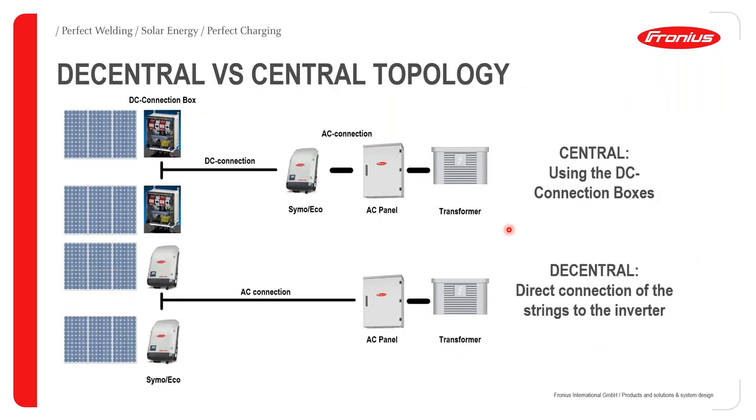In most cases, as in our large scale installations, both for centralized and decentralized topology, you can of course have our inverters well implemented. If you want to have, let's say, combiners close to the site, and then use a larger dimension cable to extend to the inverter, which is usually implemented using the DC connector kit as I showed earlier, this is very, very possible. And then if you want to have all the inverters installed at site and connected via AC cable to the control panel, this is also possible. The transformers you've seen here are just in case you want to step it up to a medium voltage level. So whatever orientation you want for your installation, whether decentralized or centralized topology, we have systems and inverters available to help you do so.